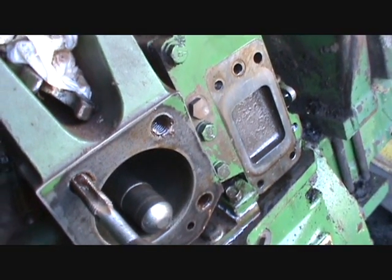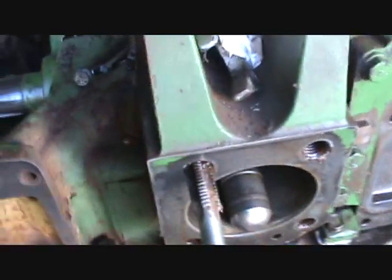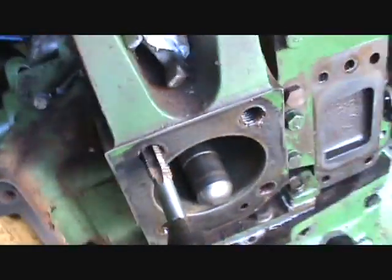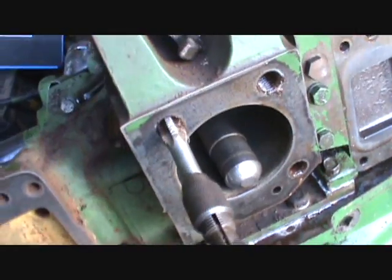For some reason I just don't have the patience to let something soak with oil and come back with the hopes it penetrated. If it's a cylinder in an engine — which I don't even mess with anymore — I leave that up to Timothy, and he'll dump diesel fuel and automatic transmission fluid down in there. That's a trick I taught him. If you want a product for that, you can use Marvel's Mystery Oil. Anyway, back to this project — you just run that tap right in there and it takes any rust right out. I've already pre-squirted the holes with the penetrating oil.